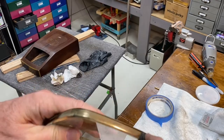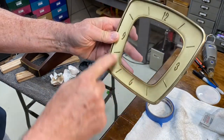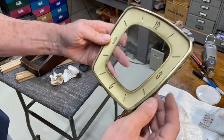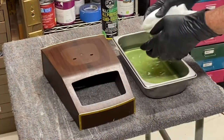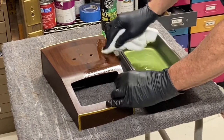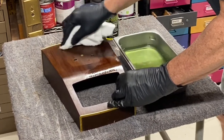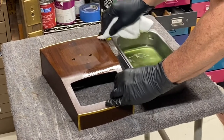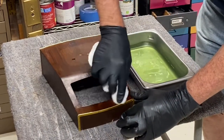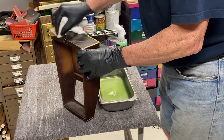I'm just going over it with some four-aught wool. It was pretty dirty — I used some Simple Green and some dish soap and got a lot of the skin oils out, and probably cigarette smoke as well. It looks much much better. The cabinet is pretty darn dirty — I believe whoever had this clock was probably a smoker. I'm using Simple Green and dish washing soap, just dabbing the water on here because this is a veneer and I don't want the water to get too far into it or compromise the bond the veneer has with the underlying wood.